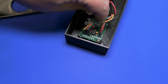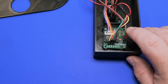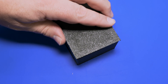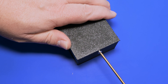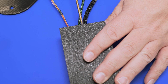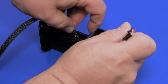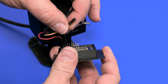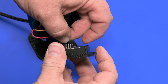Now we're going to feed in our stepper driver wire and attach it to the stepper driver. Now we need to hook up our USB power. Now that our wiring is complete, we're going to attach the lid and secure it with an M3 screw. Now we'll feed the wires running to the stepper through the 3D print which holds the ESP32. I tied a knot in the signal cable to make sure it doesn't pull back through the 3D printed part and disconnect from the ESP32.